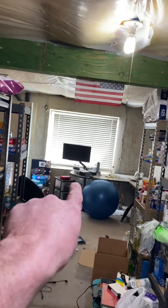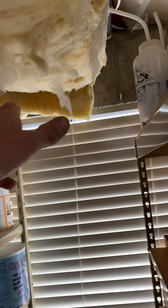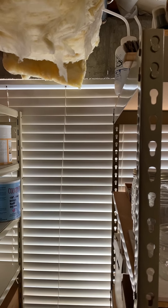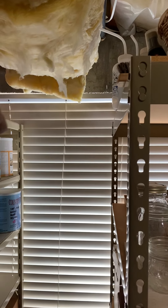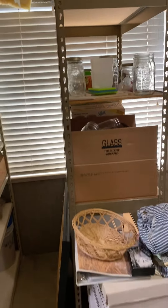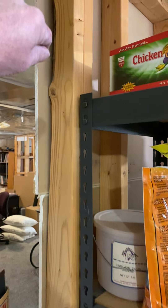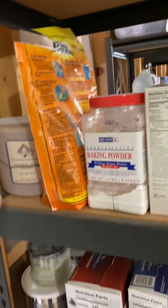Over here they're going to have — this is going to be a bedroom, and that's going to be a bedroom. This bedroom has a trunk line coming down. All we're going to do is cut a 4x10 hole in the bottom of the duct. They're actually going to probably patch it when they sheetrock — they'll put the grill on but patch it so it doesn't work, just so when they sell the house it can be sold as a bedroom. But with that we also need a transfer grill, so we're going to put a transfer grill in this room.